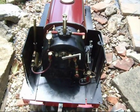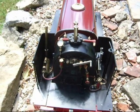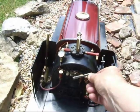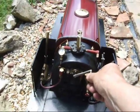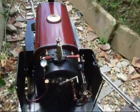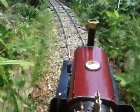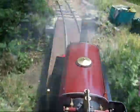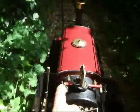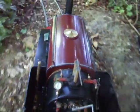We've got plenty of pressure so we're all ready for the off. On this line we're going downhill so it won't need an awful lot of steam. Put the reversing lever into full gear, open the regulator, turn the blower off and away we go. As we're just coasting down here I'll put a little bit of blower on just to maintain the fire while we're running.